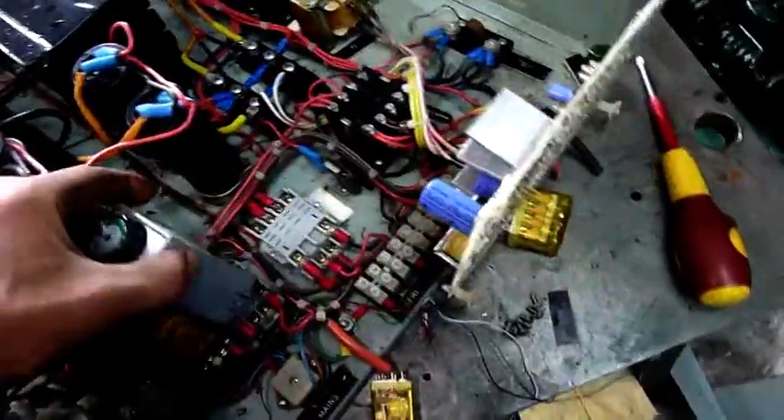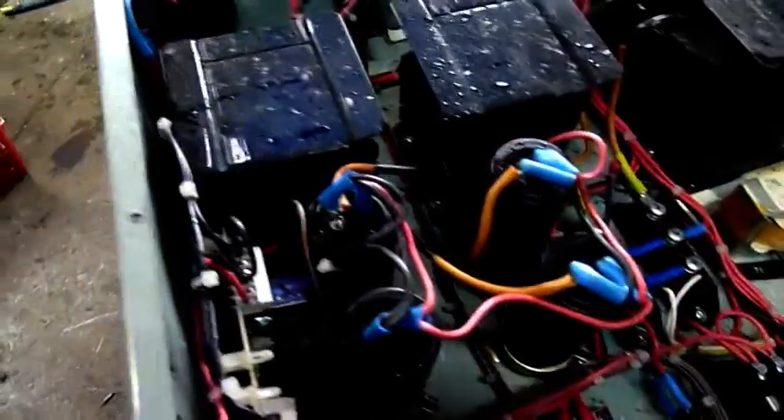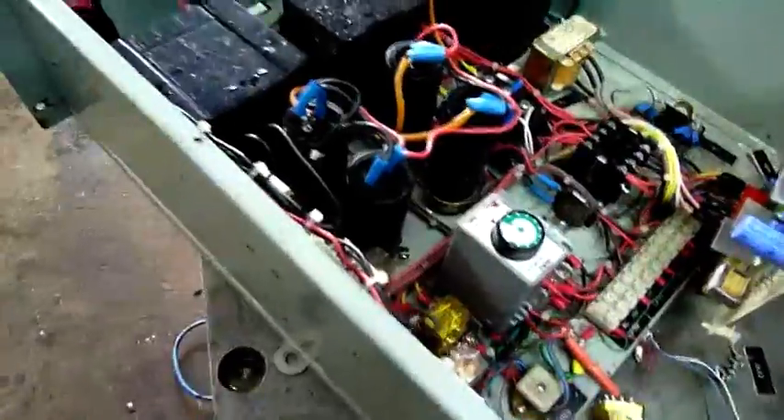I'm going to open all that up and let it dry out. That's a contactor — might be charging on/off. There's a 200 ohm 20 watt resistor. These capacitors are 75 volt, 8000 microfarad DC each, so that's pretty serious. Standard panel switches. The timer has a tiny little synchronous AC motor on it to drive it. It's coming off the rectifier — there's DC going through these two ballasts. That's the main transformer; these are ballasts. So this thing would handle pretty serious inrush current.